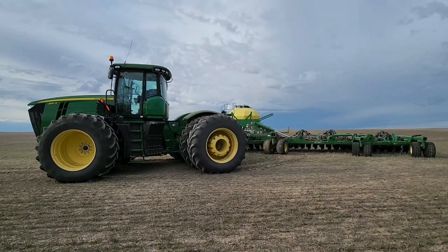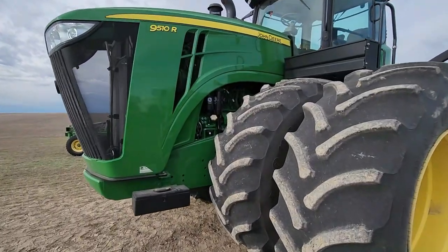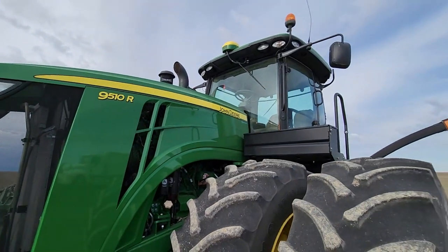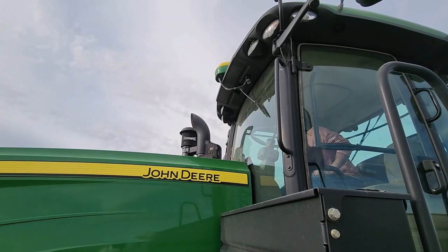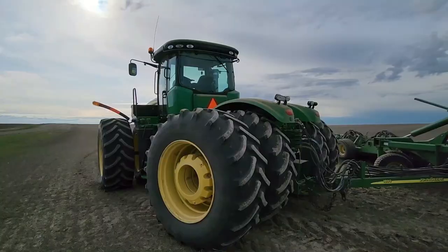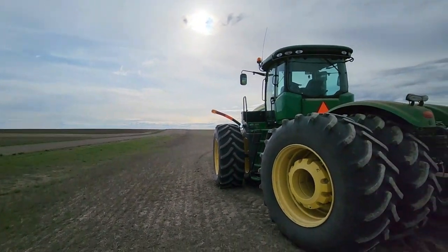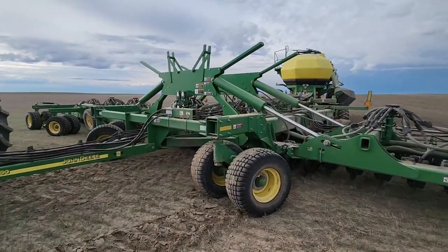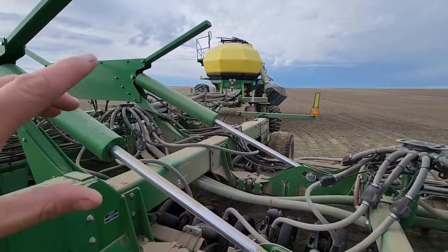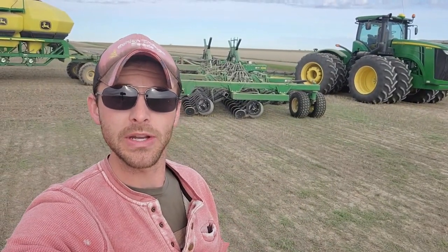It's Tuesday morning. Since we did a morning checklist with the Case IH tractor, we'll do one with the John Deere as well. The very first thing we always do with any tractor is check the oil — just did that, looking good. Once it's running, I'll move this truck down the road and walk back. After that is when we start greasing. There's quite a bit to grease on this air seeder — all these little pivot points we like to grease every morning, plus the pivot points between the air cart and air seeder itself. After greasing and letting the fan warm up, we should be ready to go.